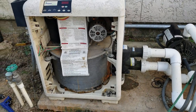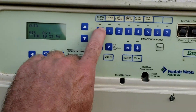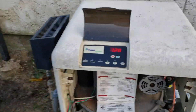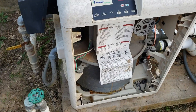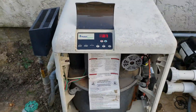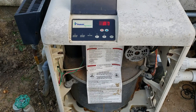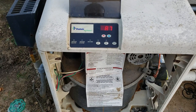Got everything back together plumbing-wise and electrical, so it's ready to test. I already know it's not leaking. I'm going to turn this back on. Here's your 128 R8 — fan spooling up, no service heater light. Turn the gas valve back on — that'd be nice. It hasn't clicked yet to turn the gas on, so it's okay to do that at that time. There was the click for the gas valve.